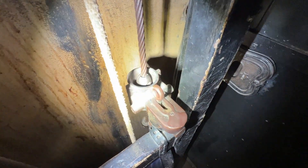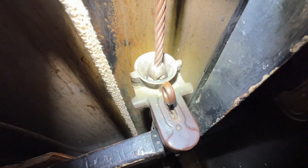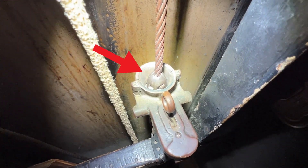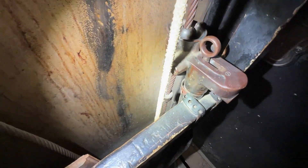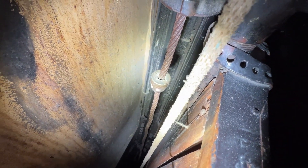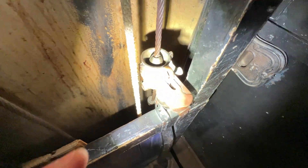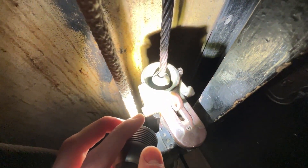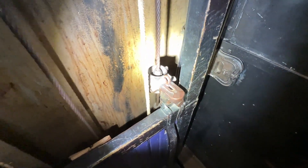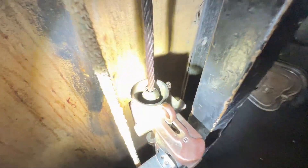This device down here is what stops the elevator. As you can see, there is an object attached to the rope, and that is part of the mechanism that stops it. And if you look down below, there's another one. This ring here in the middle is used to open and close the diameter of this ring. What that allows is for the elevator to catch on these pieces here, which I will demonstrate.